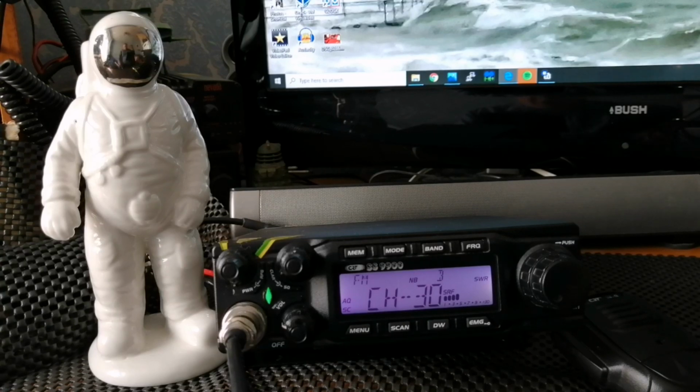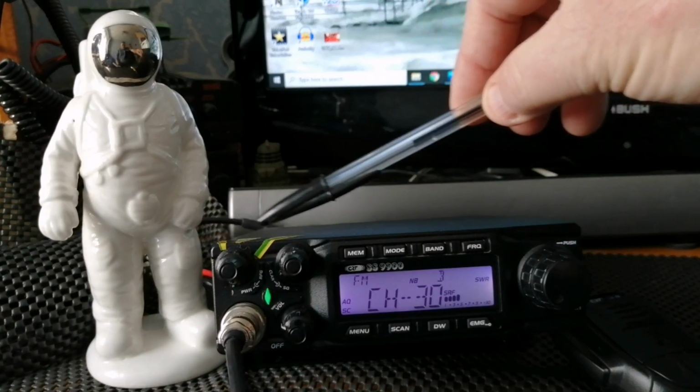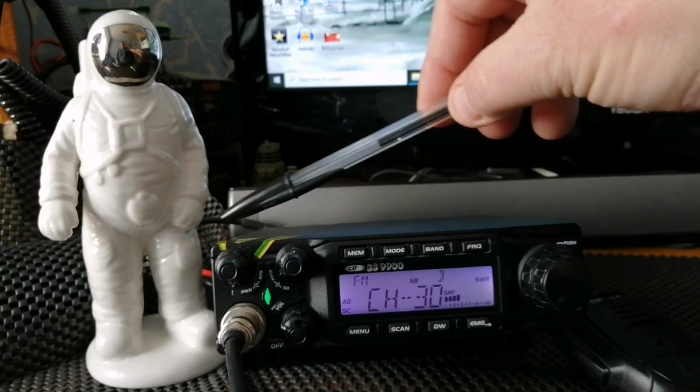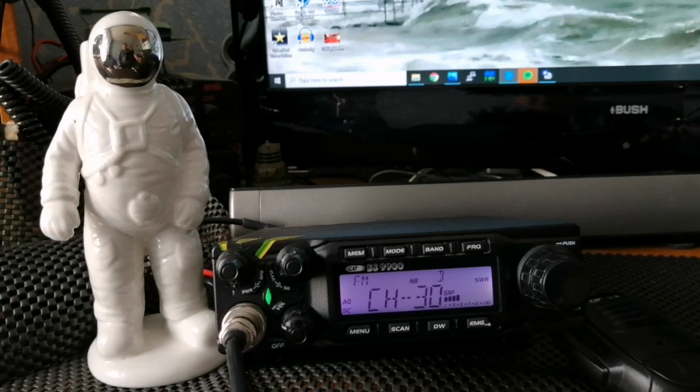On this one, if you can see, I've put little bits of tape markers. These are power settings of 40, 30, 20, and on the side, 10 watts. So when I switch over to amateur mode, I switch it back to 10 watts. I can go on 10 meters, use sideband, absolutely happy. If conditions allow, anywhere else in the bands, you have the other settings there if you need them. If you're running into a transverter or anything like that, you can turn the power right down to just a couple of watts. It's very useful.